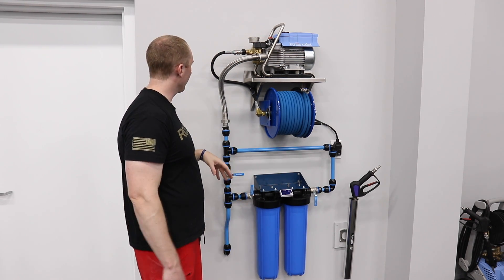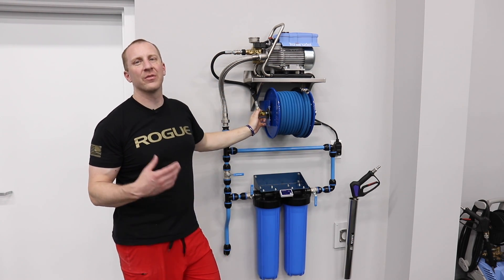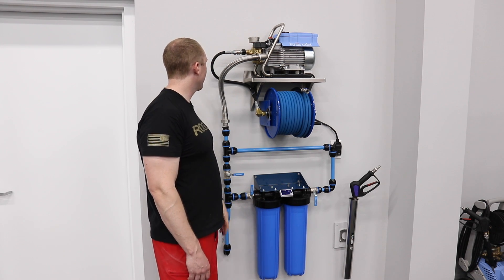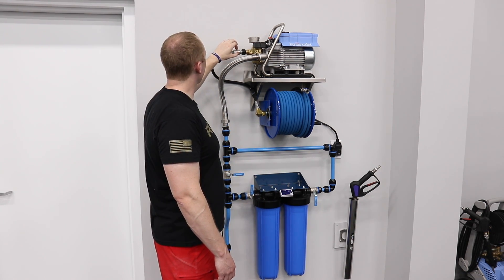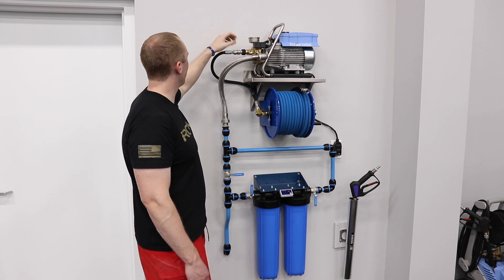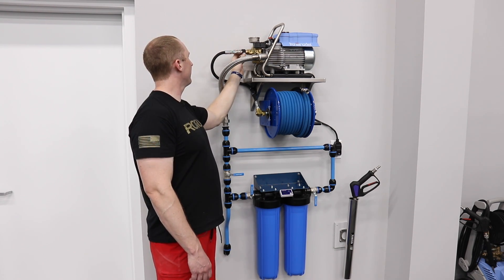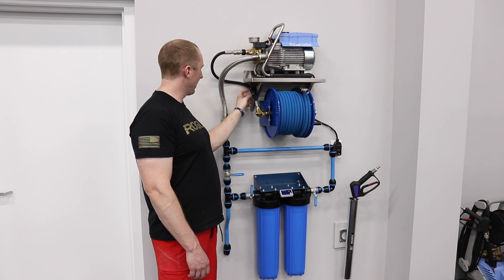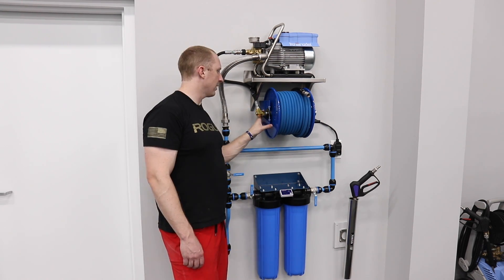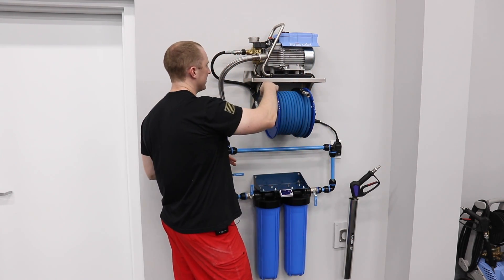From the pump outlet there's a 3/8-inch, three-foot jumper hose — I included a three-foot in the package because the two-foot was a little too tight. There's a 3/8-inch stainless steel coupler and then a plug. I have it pressurized so I won't remove it here. You can pop the quick disconnect off — I provide both the coupler and plug and the hose, as well as the anti-vibration clamps mounted to the side of the shelf to keep the swivel from rotating when you pull out the hose.